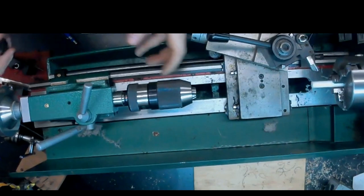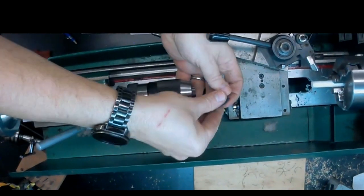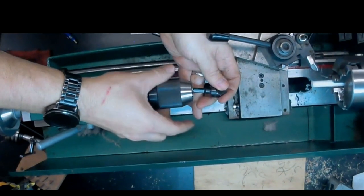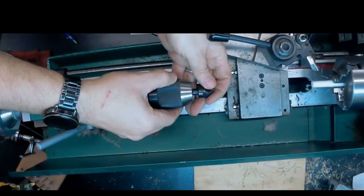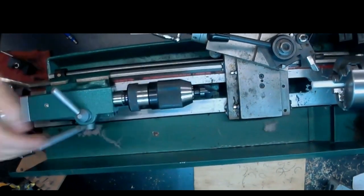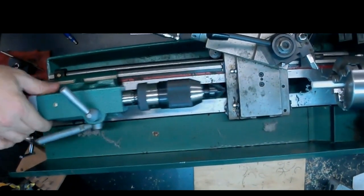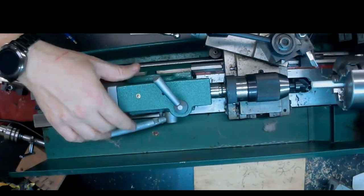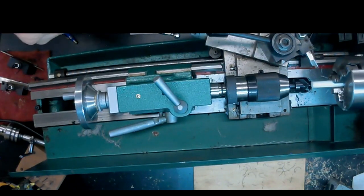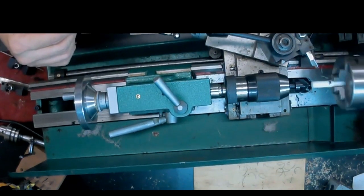All right, so now we're going to be taking care of the business end of the tenon. We're going to put an internal chamfer on that using this countersinking tool. And this is important. I really think this chamfer is very important for smoking quality, the smoke flow through the pipe. It just provides a nice, clean, smooth transition between the shank and the stem.